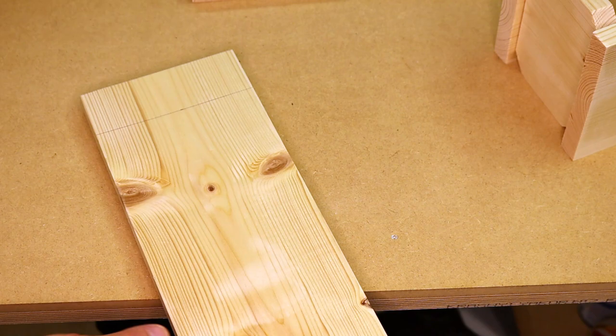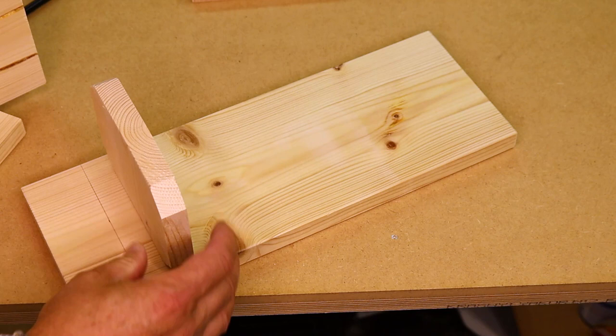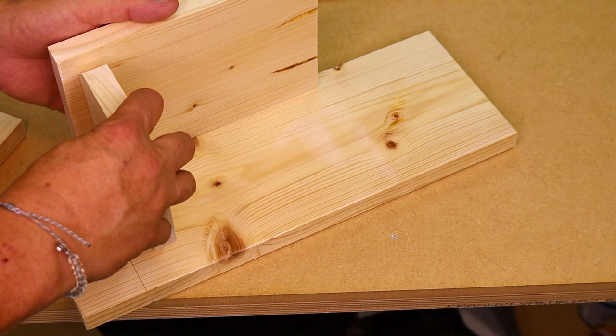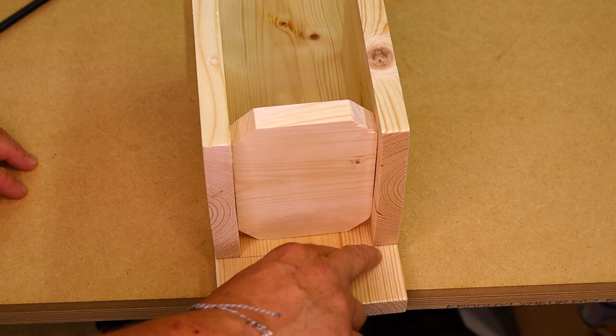So then I'll take my two side pieces, which are the two that are at 8¼, and the bottom, which is the one that I've cut the corners off. It was cut at 5½ inches wide, 4 inches, but we're going to turn it sideways so the 5½ then becomes the depth of the box. That allows us room for the two sides to get mounted like so. You can see how all that lines up. And I'm just going to align these on the bottom.